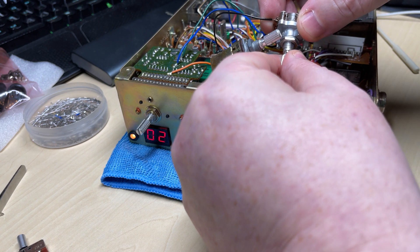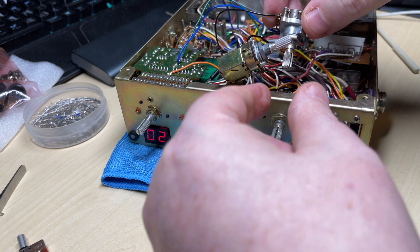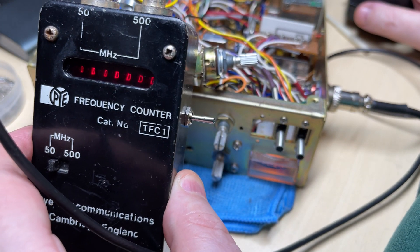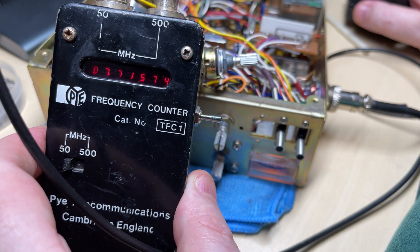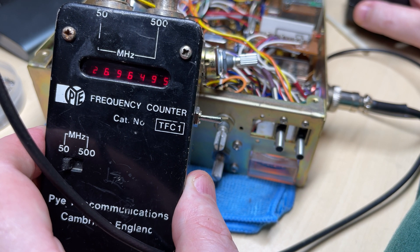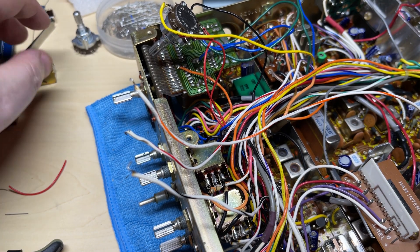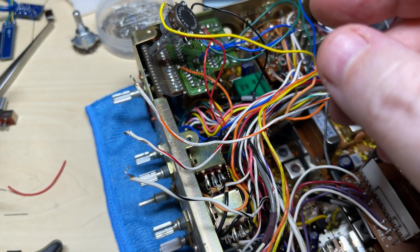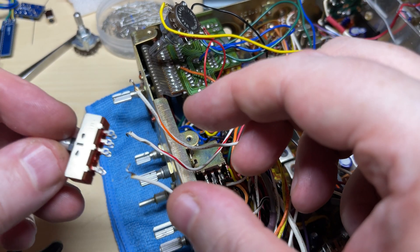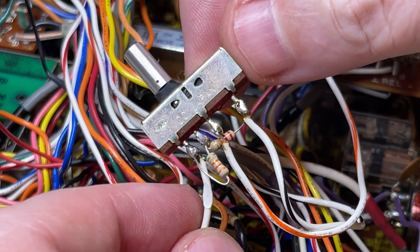Working in steps: we've got 41–80 working on high band selection and the highlight working, which will now indicate UK FM. We'll do a quick test — there's our mid band. Okay, we've got part of it working. There's our RF gain out and we're left with three wires — the center and two outer wires — so we need to try and replicate a potentiometer on a switch.